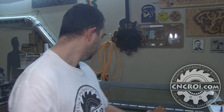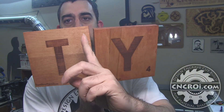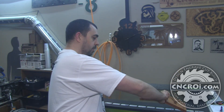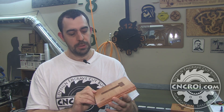If I do two tiles at once, the laser is wasting time traveling between them doing nothing. For something like this that would normally be relatively fast to laser engrave, it becomes relatively slow because I'm going over so much empty area where the laser beam is off and nothing is happening — essentially wasted laser time.